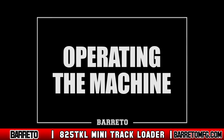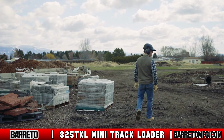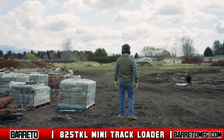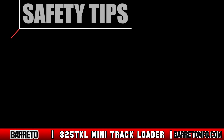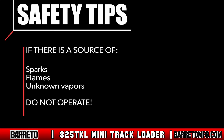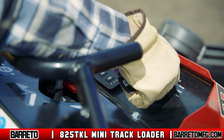Operating the machine. When you arrive on site, always do a site assessment first. Look around for any conditions or obstructions that could hinder loading or make operating the machine unsafe for anyone. If there is a source of sparks, flames, or unknown vapors nearby, do not operate. When your assessment is complete, set the throttle to low. Turn the key to accessory.